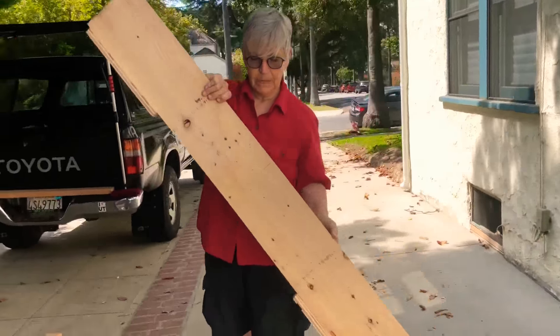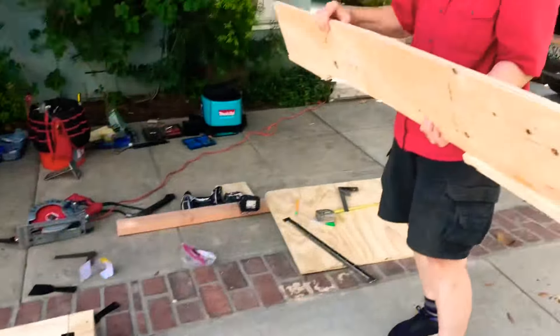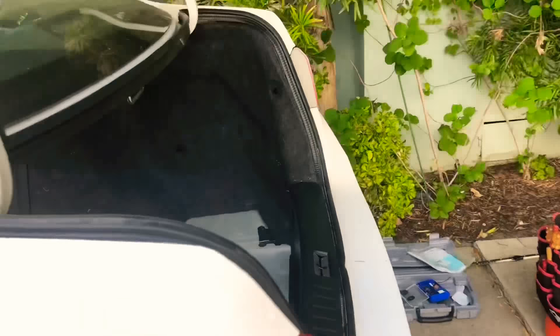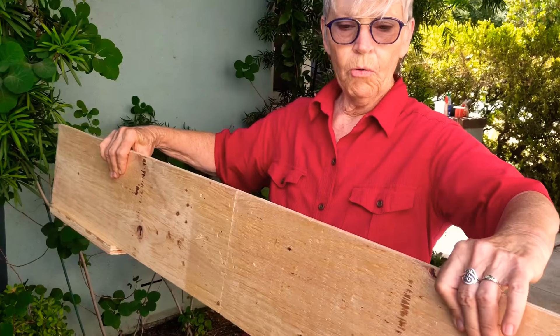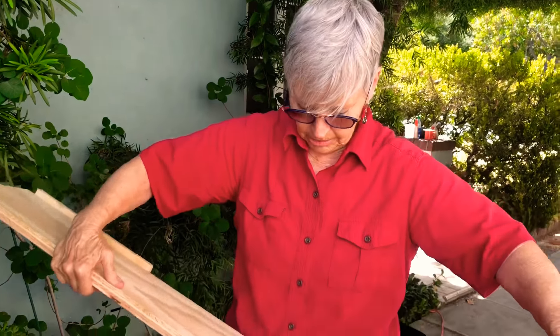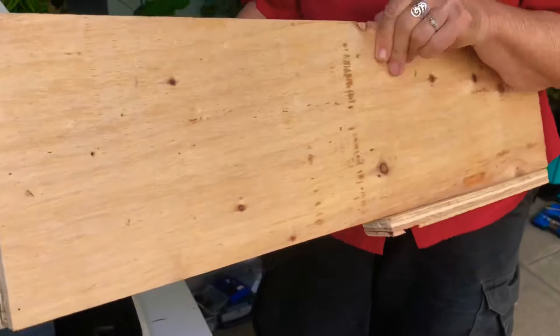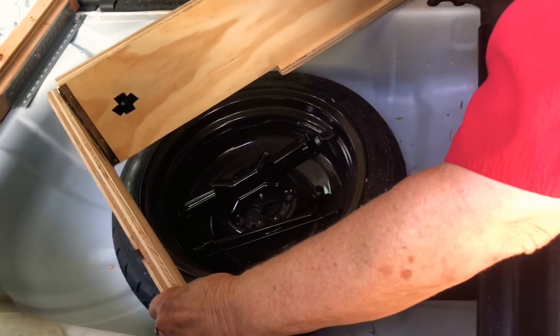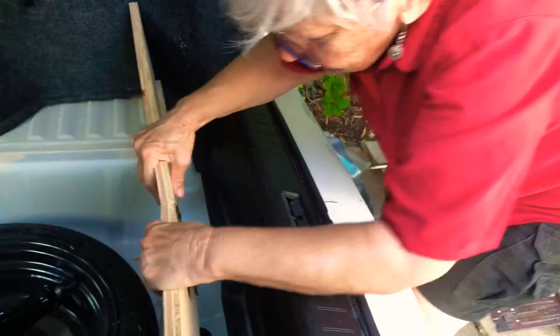This little contraption ends up being the support for the end of the bed. You see that it's wider than the actual front bed section, because it spans the whole interior width of the back of the Nissan Sentra. There are a lot of obstructions back there. So what we did was first measured the whole width we needed, because we want a press fit — not secured by any nails or bolts. In order to get this in, we added a little piano hinge so that we can bend it and put it inside. We had to shim it up to get to the right height of the other bed box, so we added shims on the bottom and slip it inside, then bring it back to location and snap it into place. Then we straighten it out to where it's supposed to be.